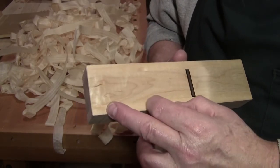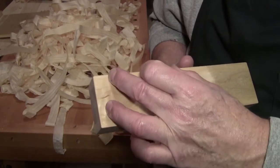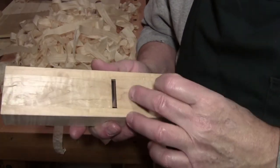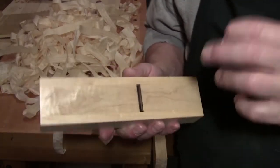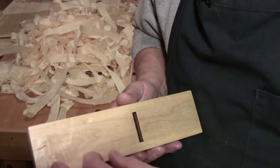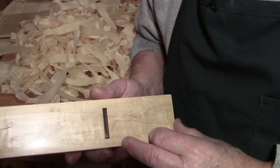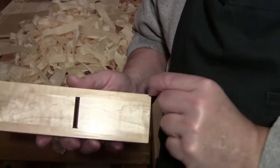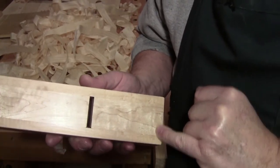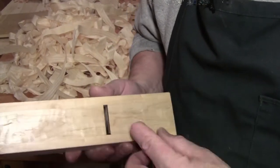Japanese style planes are tuned differently. Their sole has a hollow section in the middle. You can read up on this and research on the internet. For different applications they will sometimes have solid wood around the blade and solid wood in the front, but then a slight — I'm talking thousandths of an inch hollow here and thousandths of an inch hollow back here. Sometimes they have solid wood all the way in the back. So I'm going to go with leaving the back, leaving either side of the blade, leaving the front, but I'm going to hollow this section just a little bit. That'll reduce some of the resistance.